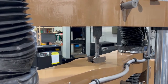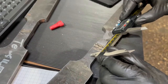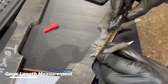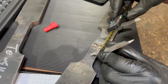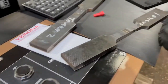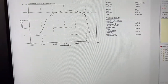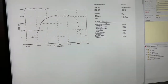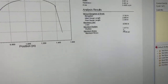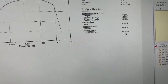This specimen was gauge-punched so I know the initial gauge length was two inches. After testing, I'm remeasuring and we got 2.34 inches — that's how much the specimen stretched. Here's our graph: manual elongation of 17%, maximum load 32,365 pounds, maximum position 1.47 inches, and maximum stress of 71,108 psi.